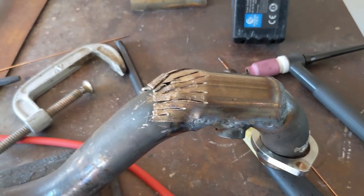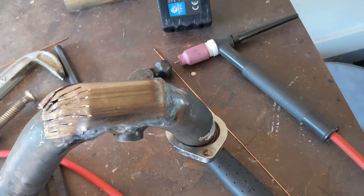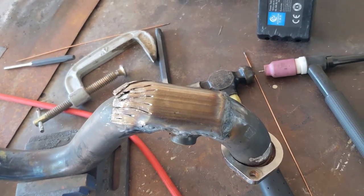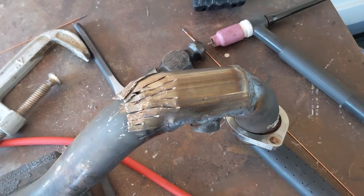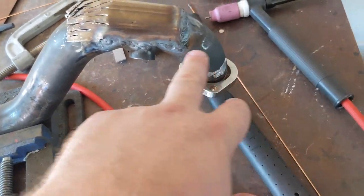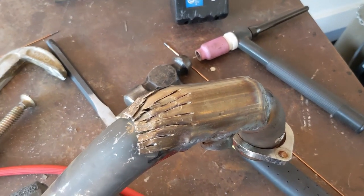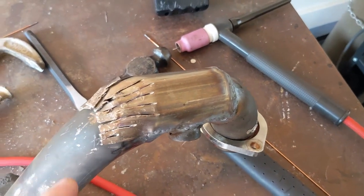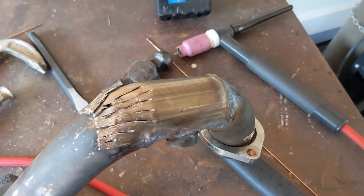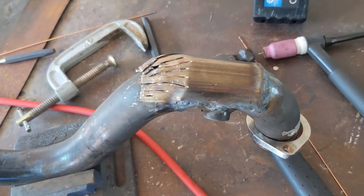We welded along all of this and then I basically made incisions here and then hammered it smooth because I didn't have material with this radius curve — and this wall thickness material is significantly thicker than what this factory pipe is made out of. So I wanted to reinforce it along both sides. It's fully welded on three sides, then we made incisions to be able to reform it. Now all I'm really going to do is go through and carefully TIG weld all of this up.